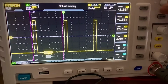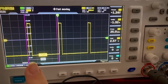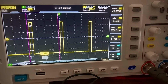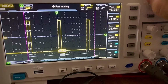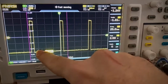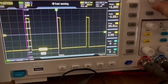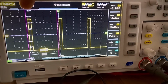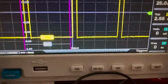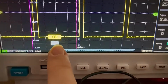And you're gonna select what is a cycle, right? You don't go and select everything here and say, that's what I want to capture. No, you want to select a cycle. So in this case, the cycle is up, down, and then up again, for instance. I want something like this, right? So I'm capturing exactly 1 cycle. I don't know if it's clear, but it's showing here the cycle, and channel 1.